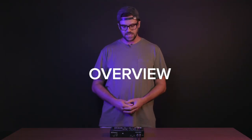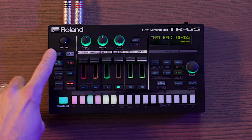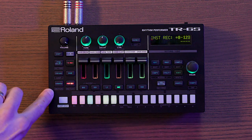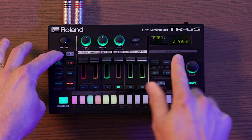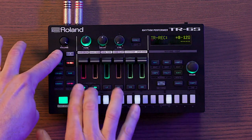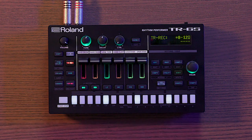Let's start with an overview of the TR-6S panels and controls. Starting with the volume knob — self-explanatory, turns your master level up and down. We also have a shift button, which is really important to the functionality of the TR-6S. If you want to access any of the secondary functions silkscreened underneath the buttons, hold shift to get to those. You can also use shift for changing values like tempo decimals, or to mute tracks on and off in TR record mode. We also have a clear button to erase programming or track data. Pattern select lets you access any of your patterns — basically another word for the beats we're making.